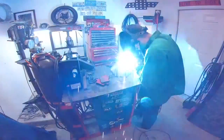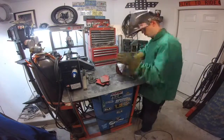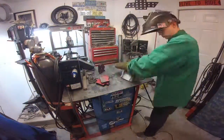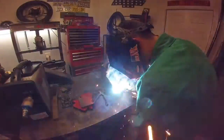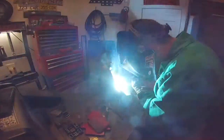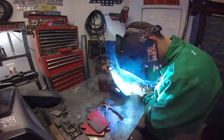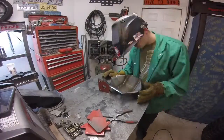When I was doing it I was always welding the opposite side, so if I was welding on the bottom right, the next pass would be on the top left, then let it cool, then bottom left, then top right. Once the outside is all welded you can go ahead, flip it over, and completely weld out the inside now.